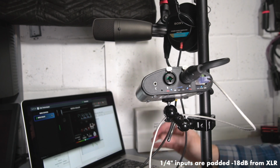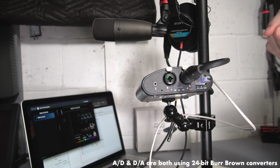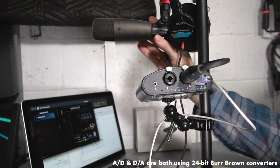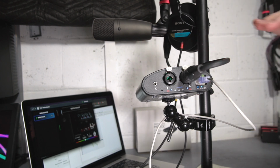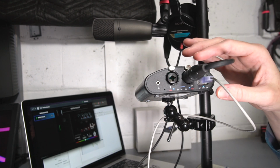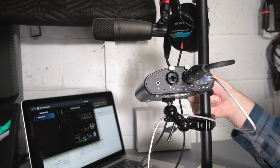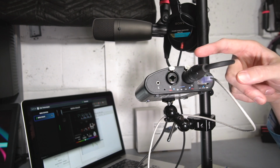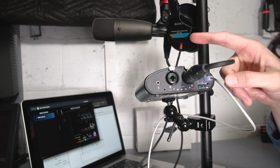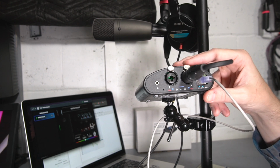As well as one thing that I really miss at the input level is a high pass filter before you hit the converters. So that's one thing I noticed right away plugging in a condenser mic to talk into, is the high pass filter is really kind of necessary before the converter. So one criticism I have there is that's not available either in software or hardware form, but a high pass filter before the converters would just be really useful in a lot of situations, especially for that local monitor, because obviously you can process with a high pass filter when you get the signal back to the console or wherever it's going. But for the local monitoring, especially with in-ear monitors, using a condenser mic and even talking into it, it was definitely an issue.